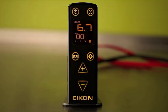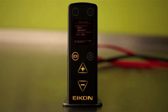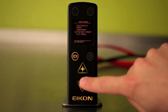To access the EMS400's menu options, press and hold the display button for 3 seconds, releasing after the second audio chime. The menu list is navigated using the plus and minus buttons, and selections are made using the display button.